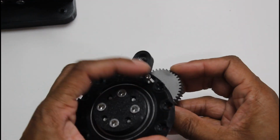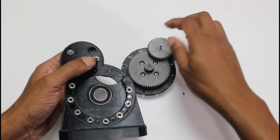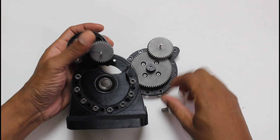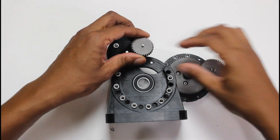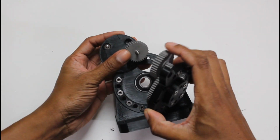This will be followed by inserting another M3 6mm screw through the bearing we just inserted. Now I'll start pushing the gears into place as well as the 2 of each of our M3 screws. I'll also place a couple of small washers in between my gears to reduce the friction from the constant movement of the gears against the plastic.